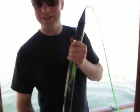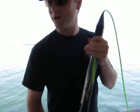The advantage to having a towed array like this is that you can listen while you're moving the boat. With a normal hydrophone, again, because the water flows over it and makes noise, you can't move the boat at all while you're listening.